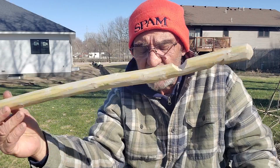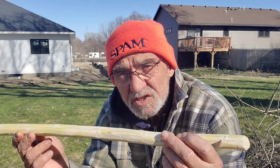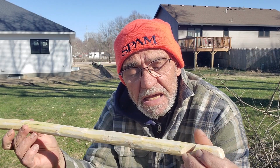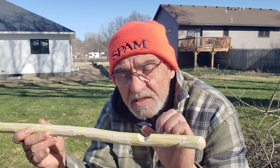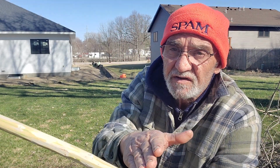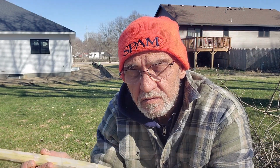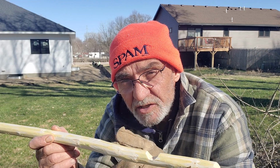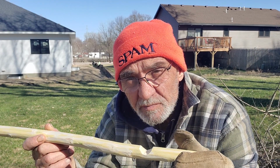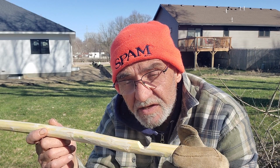The next notch we need to do is called the saddle notch, and it's one of those notches that is used in log building as well. The difference is there's no round pieces to it. Basically what you're going to do is 45 in with a little flat piece in the middle. And if you're wondering why we made a round one and then we're doing a saddle, what's the point? Just do the saddle. It's quicker and easier, doesn't need any rounding off.